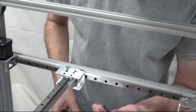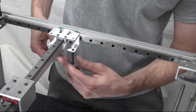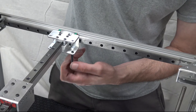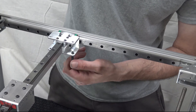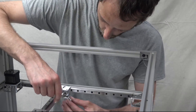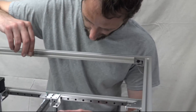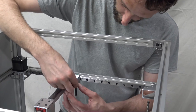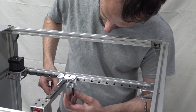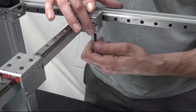What I do is I actually use two screws. I start with one that I use just for alignment. This isn't how the screw goes into the carriage, but I use it as a post to actually get everything to line up, and I gradually turn it up as I stack the washer and spacer stack. So I'm going to put a 5mm washer right there, put on the spacer, then screw this in so it goes up — using it as a little post to help line up everything.